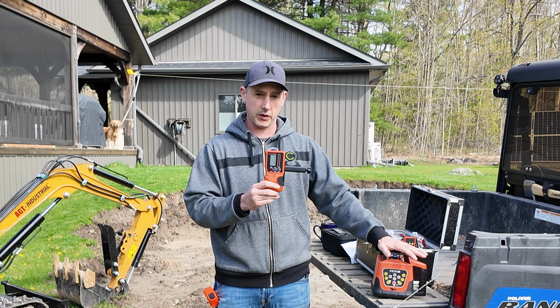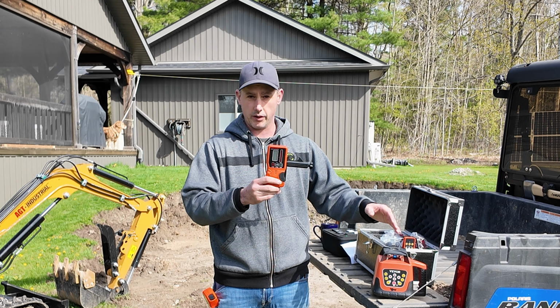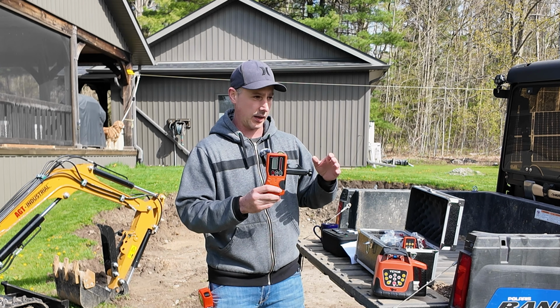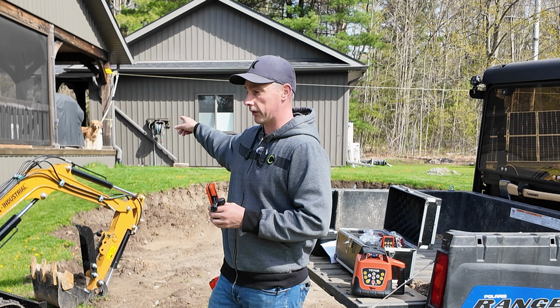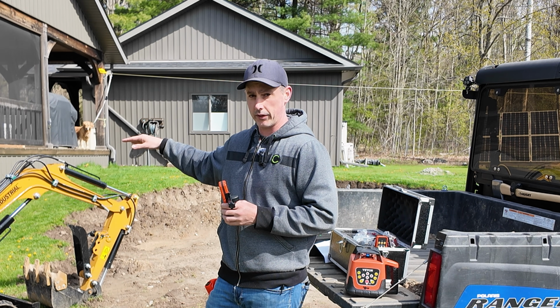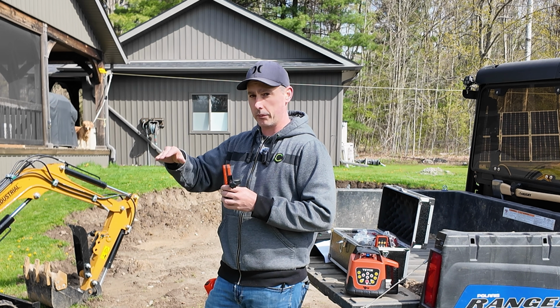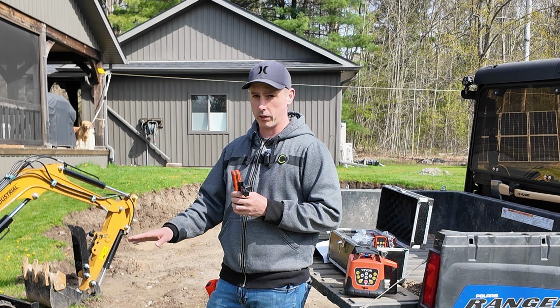So you would set this up to your determined height, or you can measure it out on a stick. The way I'm going to do it is place that rotary laser on top of that deck over there. And then I want a 7-inch step down off the deck. And then from the bottom trim cap of my pool to grade level, 50 3/4 inches.